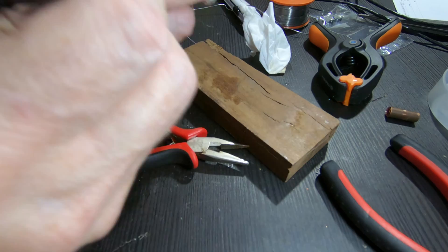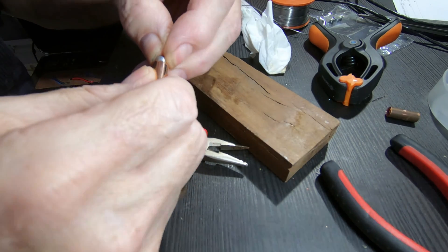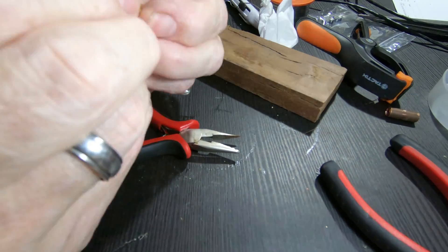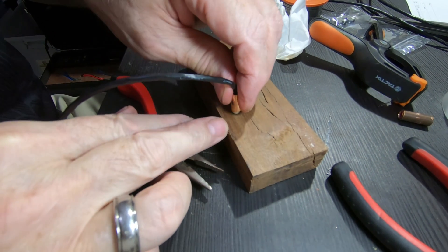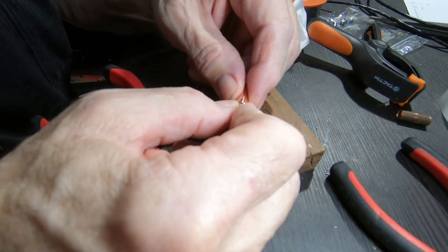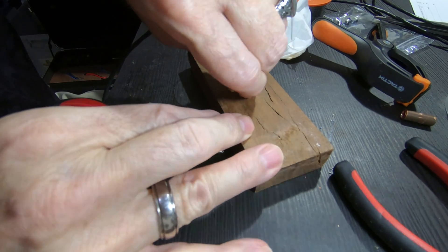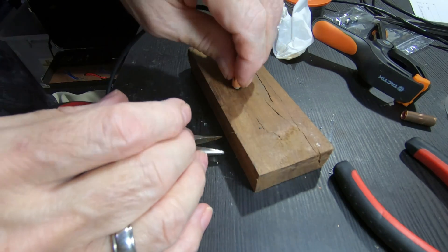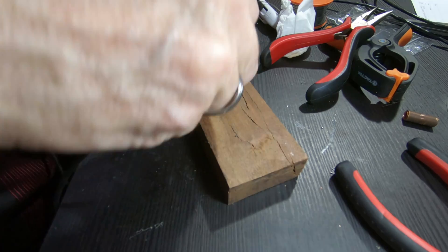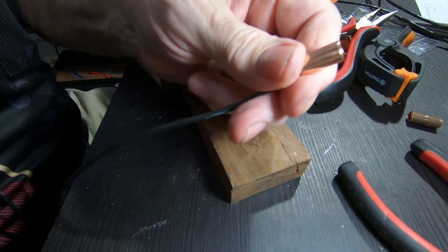Carefully inspect your microphone capsule — it looks undamaged. Very nice. If it's damaged, try again and use another one. Let me get this to fit in here. Squeezing in carefully, gently. What I do is put it on something flat like this and carefully press it squarely. If it's not going to press squarely, that means we didn't do a very good honing job. Get it square, get it straight — if it starts going in crooked, don't let it. Now it's squeezing in. That copper is soft; the aluminum also is soft, and they will touch each other and make a contact, pushing it down until it rests at the end. There's your mic.